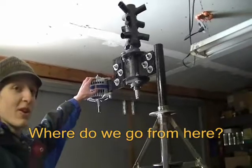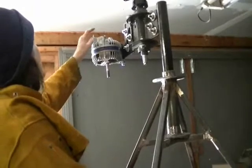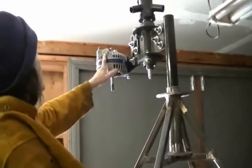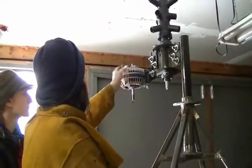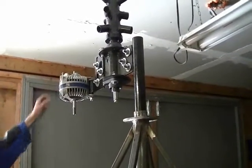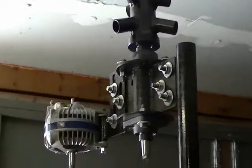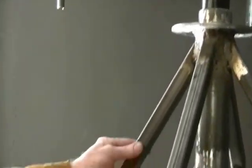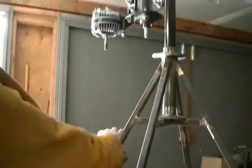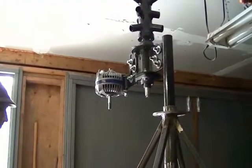Are you actually getting the power from the alternator to your house or whatever you're trying to power? You've got one electrode here, that's your positive, and then the case is negative, or ground. You can see the ground there. So you just put on a common house wire, like 12-2G, wire that on, and then loop it around, and put it in plastic conduit from here all the way down. Okay.